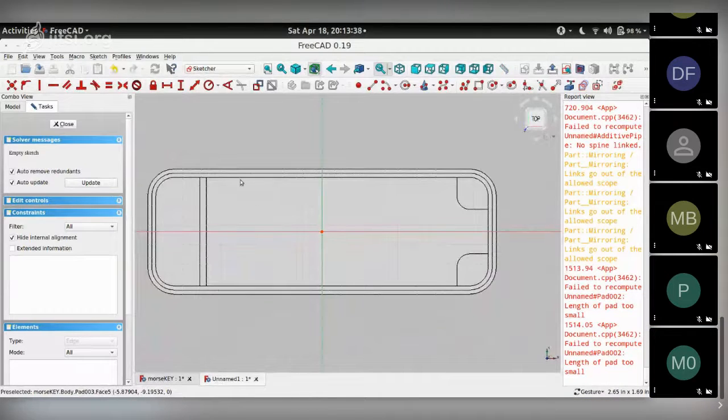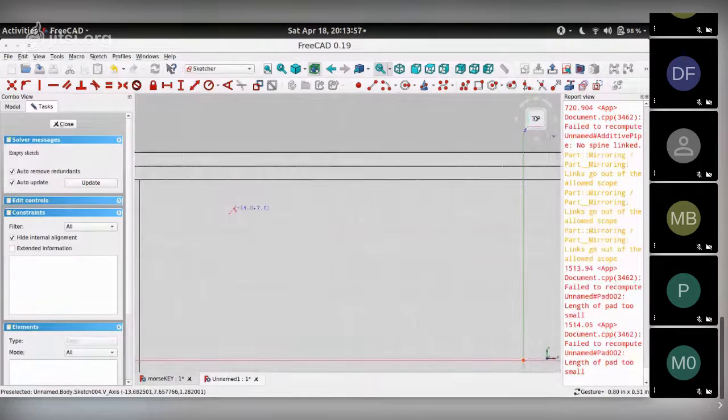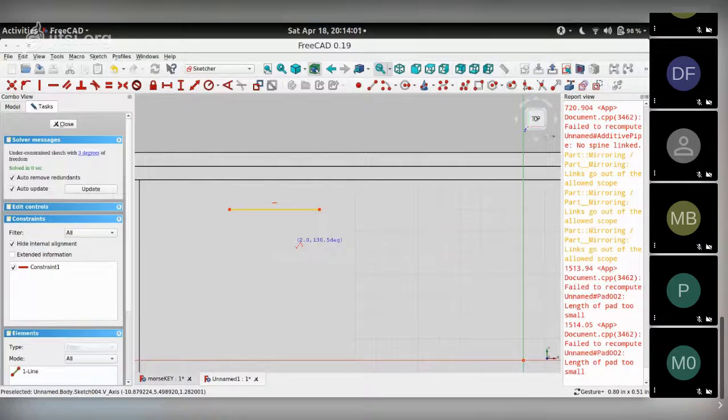I'm going to draw two semicircular supports here and then mirror them on the other side because at least along the horizontal axis they are mirrored, but they aren't mirrored along the vertical y-axis. So I'm going to try and make the polyline option, zoom in, draw a horizontal line like so. Using the M key, I can get to the arcs and create an arc.